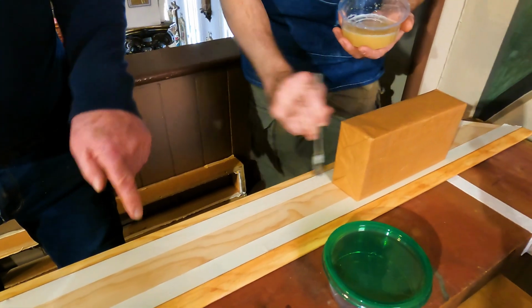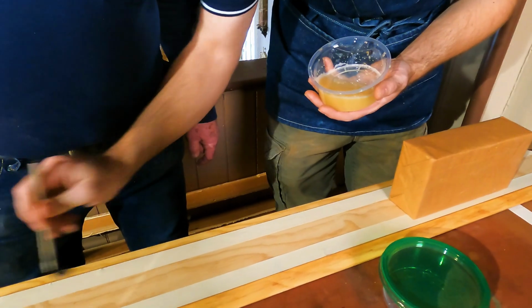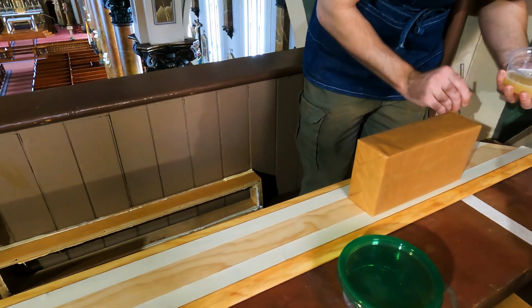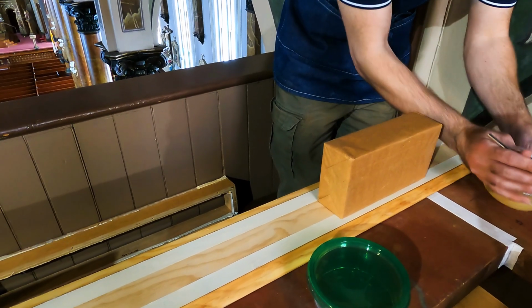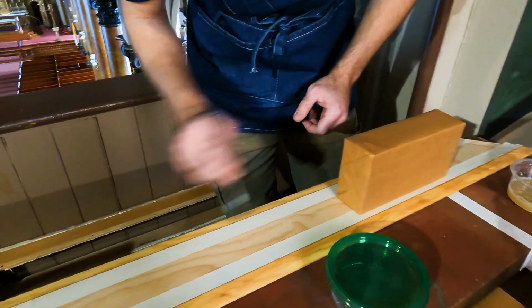Since there was extra water in that sizing glue, we would paint all of the surfaces we were going to glue to, and we would go all the way around the reservoir in one operation. By the time we got to where we started, it was bone dry because it's so dry in here. Even the glue, when we used it, is fairly thick. We had to cut it a little bit with water to keep it workable. We'd get through with one operation and the glue container is open, and we would have to add some more water because so much had evaporated by the dryness that it was getting too thick again.